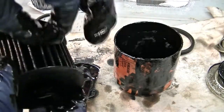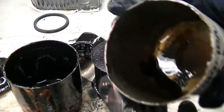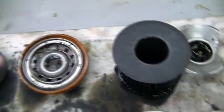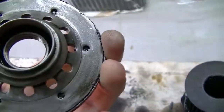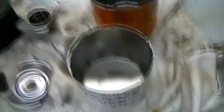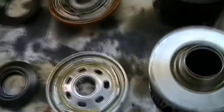There's a little metal clip here that keeps them together. And on the Valvoline, you can see all the stuff that it filtered out — there's quite a bit in there. So here they are, all the parts cleaned up, so you can see them in a little bit better detail. A lot of the sludge I found had actually been on the back of the anti-drainback valve and around where it seals — that's where most of the contaminants were. This filter was in a horizontal position on the tractor, so I'm not surprised that the contaminants went to the side or the top. The Valvoline was on an angle — just kind of on a slant — and it kind of showed that too, because a lot of the contaminants were more on one side. The oil gets much thicker on the Valvoline than on this one, but you can't really compare them because these are two different filters that went on two different things.